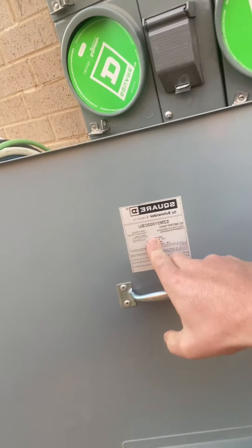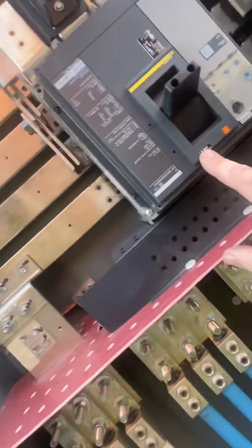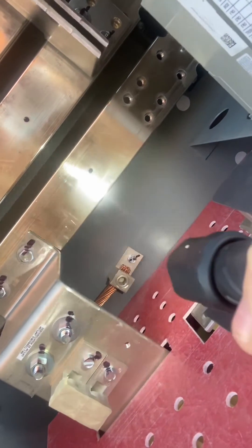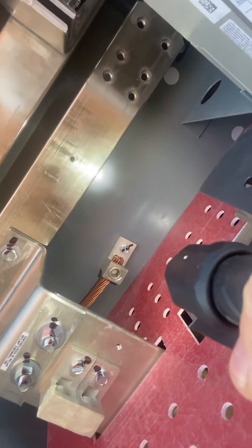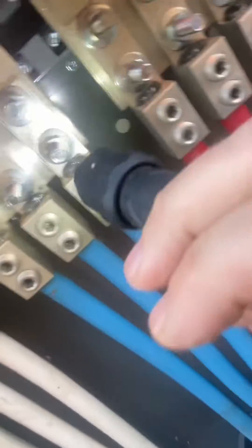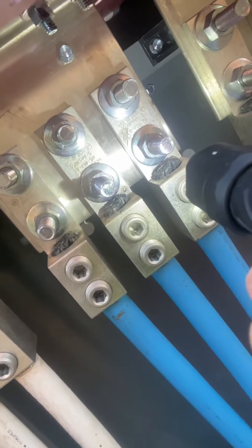Code coach — today we're doing electrical service. Good place to start right here, looking at our panel max size: 1000 amp. You got your cabinet grounded in the back, listed lugs, as well as terminals marked and torqued properly.